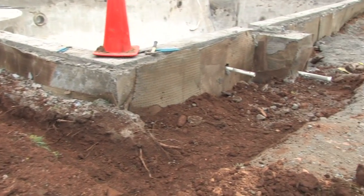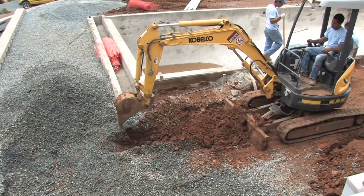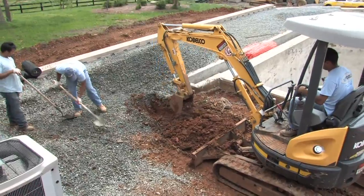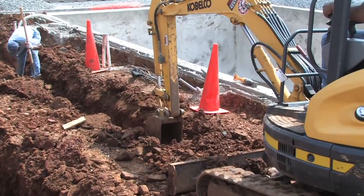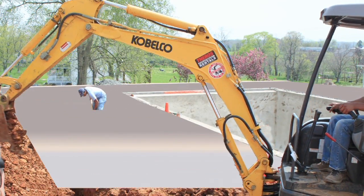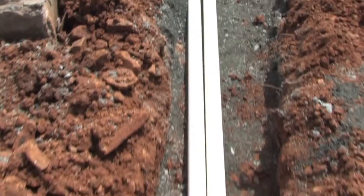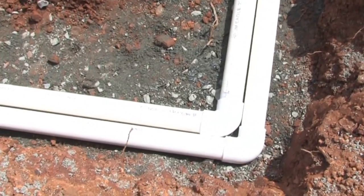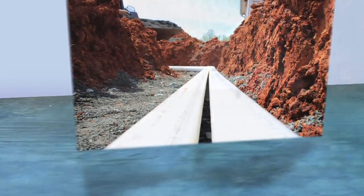After the gunite has set, the plumbing for the pool systems must be laid in the ground and run all the way back to the future location of the filter machinery. The pipes are set as deep as 24 inches below what will be the final grade of the pool deck. The bottom of the trenches are covered with a layer of stone dust to help cushion the PVC from the surrounding soil and rock. Once the plumbing is complete and pressure tested, more stone dust will be laid on top of the pipes and the trenches will be covered again in soil.